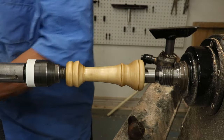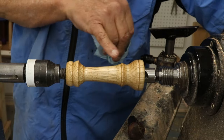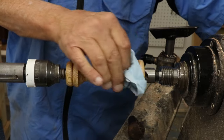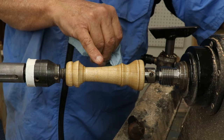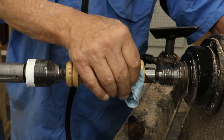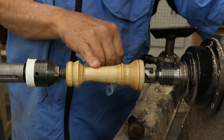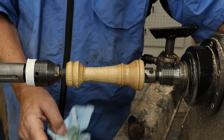I can see that this piece of wood is still wet, so I'm going to just rub that in a little bit. I can see a little shinier finish. If you build up two or three or four coats, you might get a little bit more shine. One aspect of applying either lacquer or shellac is each subsequent coat of finish will blend into the previous coat. The only way to really build up a heavy, thick coat is to spray it — spray the shellac on there, let it dry, keep spraying; you could put five or ten coats on there. The coat I just put on blends in with the previous coat of shellac.